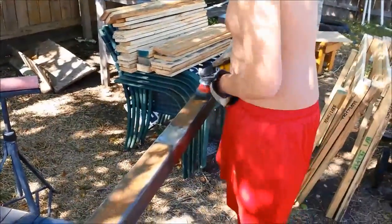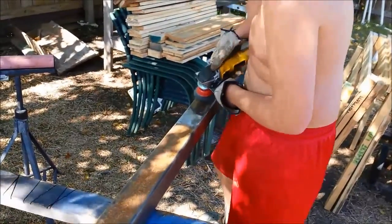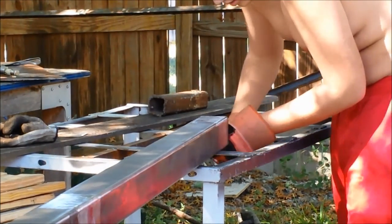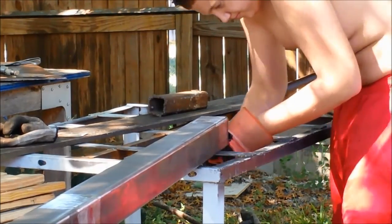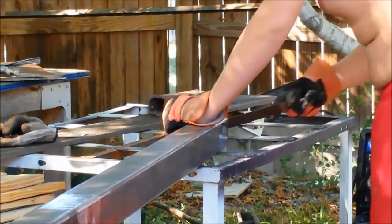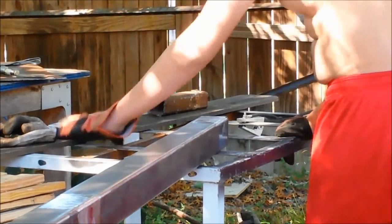Hey Philip, what are you making there? So what we're doing is getting ready to start welding up that tongue. He's just gonna cap that in, probably this end open so it gets a little air and dries out, but that one's gonna be the end underneath the trailer. We're gonna go ahead and cap that - got it all prepped, got a little square piece cut out, fix an attachment on, and weld them up. It'll be right underneath there and that's what's next.